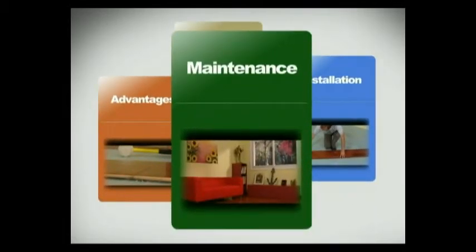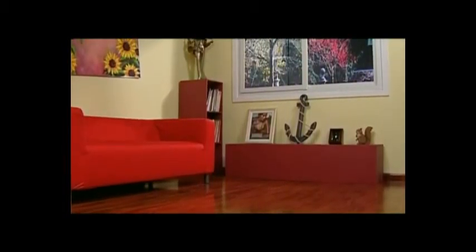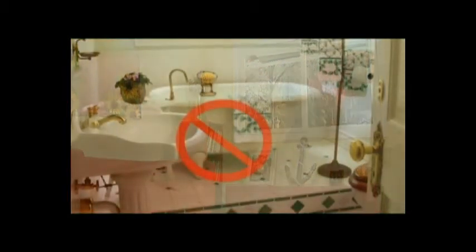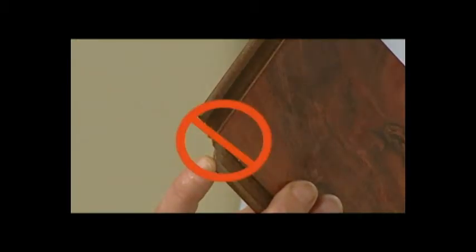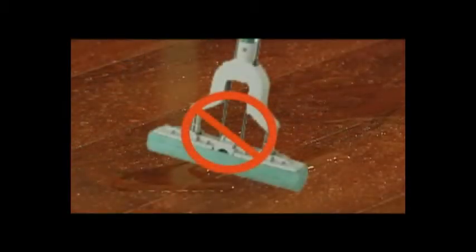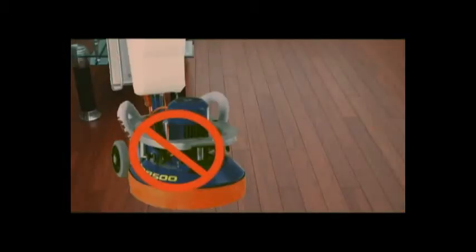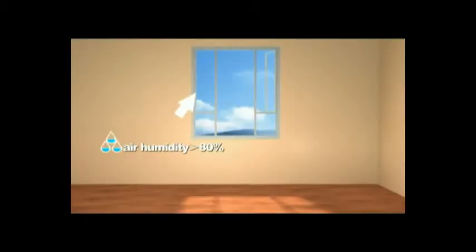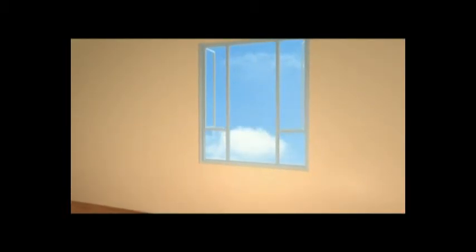Maintenance. The elegant Tap & Go flooring needs good maintenance. Do not install a floor in a high moisture place. Do not use broken planks. Do not use a wet mop. No chemical materials should flood onto the flooring. No need to polish or paint. Air humidity above 80% requires dehumidifying; below 30% requires increasing humidity. Open the window at regular intervals when there are no people living in the space.